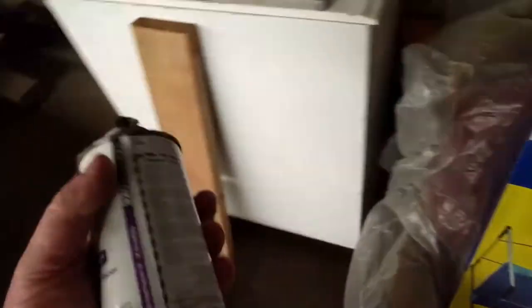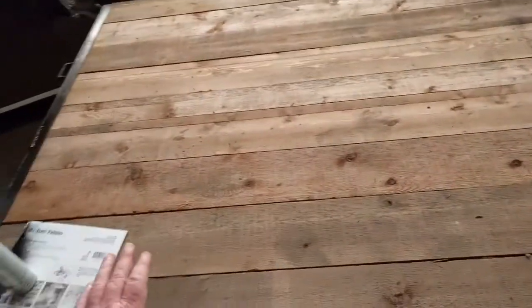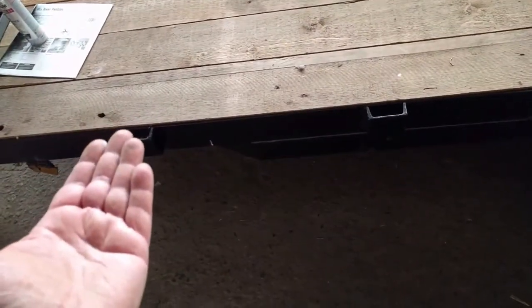Next I'm going to sweep off the whole deck. There's a roll of 30-pound felt paper over there — I'm going to felt-paper the whole top of this deck, leaving a little more than 10 inches hanging out on each side to make sure I can wrap it up underneath on the exposed part of the floor to keep that waterproof. Then I'm going to cap the underside with some plywood.